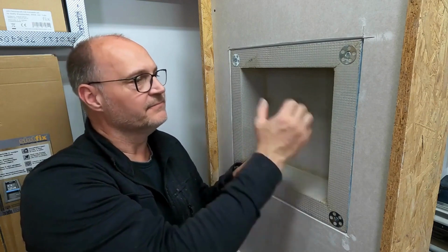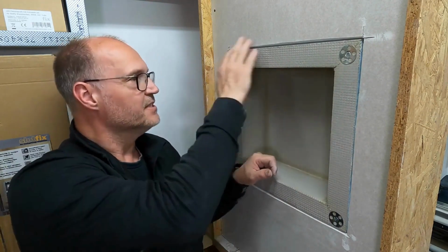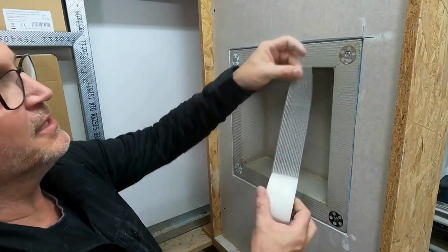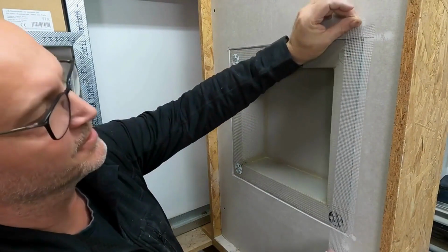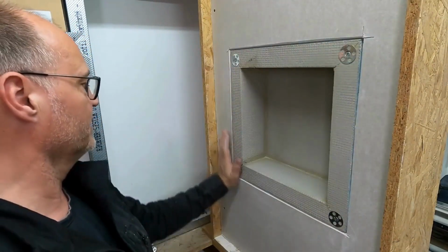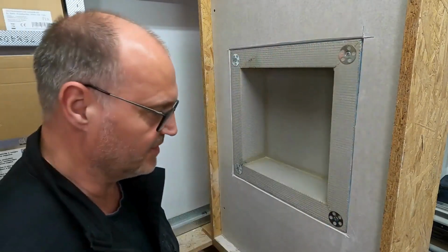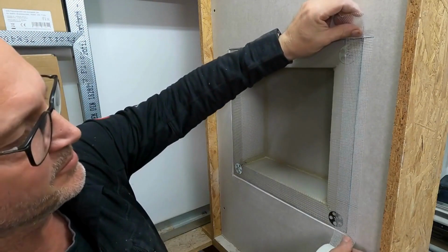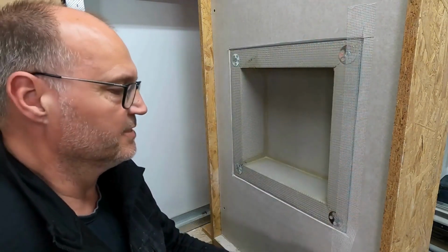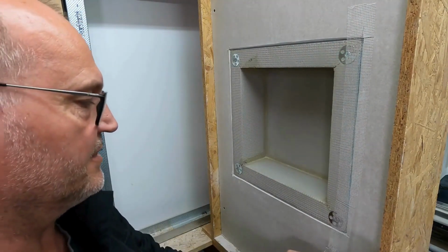And that's all on that. I can, of course, also simply rework it with plaster. And in this case, I would now apply mesh here. I will, of course, also show that. In this case, I recommend this Gytex tape. First, of course, remove the dust. Also here, it's best to always moisten these joints with water a bit. Brush, and then apply the Gytex. This increases the stability.